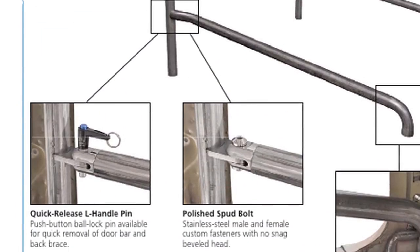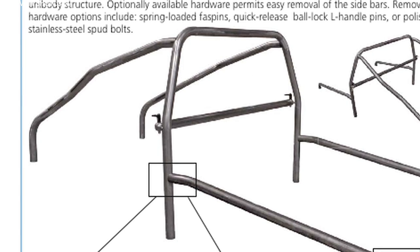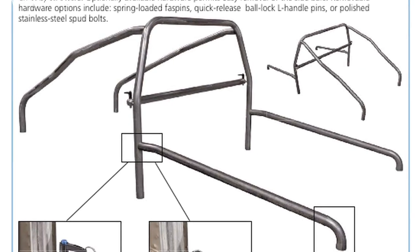It's very tempting to just put it in there, and if you don't pay attention the driver will be sitting too close to the steering wheel. This kit comes with a bar that is bent to accommodate that, and then you have to position it where you need it to be. This bar is also part of the restraint system in the car, so you want to make sure that if you have a three-point or five-point seat belt, it all interacts properly and safely.